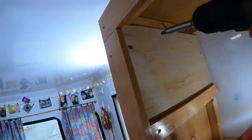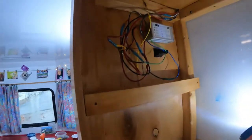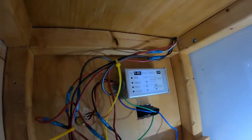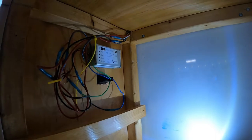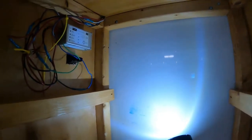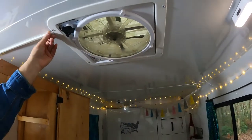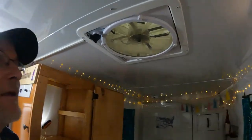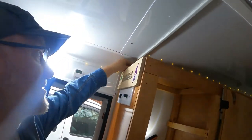I'll give you a look inside here to show you what the backside looks like. That's the controller there. I got it off of eBay for $16. I'll put a link down in the description to the exact one that I found that works. Took a little bit to figure that out. I didn't want to have to pull the ceiling trim to run my wiring up through the ceiling and then have to re-caulk and everything. So I used just that little cord hider here to run it across the ceiling and then down into this. Worked out pretty well for me.